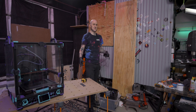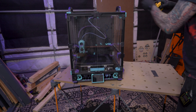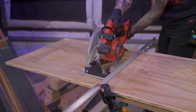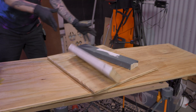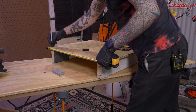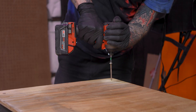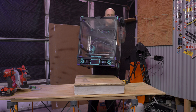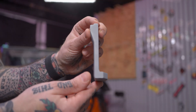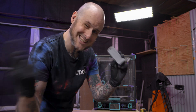So it's going to be a great piece to cut down for bases for these crates. I measured my base to be just wider than the machine at its widest point — I don't intend to put any packing material in here, just relying on the crate itself to protect the outside. That happened to land at 20 inches wide, so I cross-cut a piece of plywood at 20 inches, grabbed a couple of 2x4s, and I actually had a pair from the workbench that were exactly 20 inches. Then I marked where I wanted the feet to land — nine and three-quarter inches off of the center point of the base plywood. I designed a printable bracket that mounts to the front and back of the machine's bottom extrusions and then screws down into the base to hold the machine down.